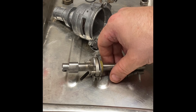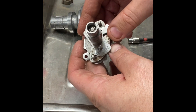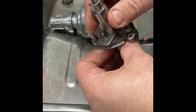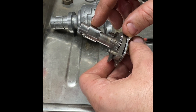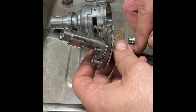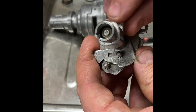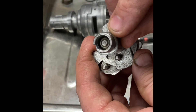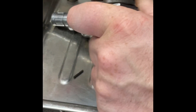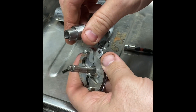Here's a 59D that I've got in for working on at the moment. As you can see, I've stripped the unit down. What I wanted to show you was the modification to make a more permanent and more rigid, reliable fitting to retain the end of this cam on this shaft. If you can look in there, you will see that there is a little plastic collar. I'll push this one on, but if I just pull that, you will see that it will come straight off.